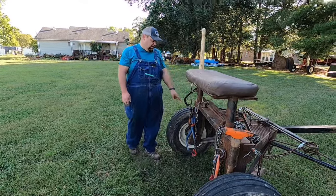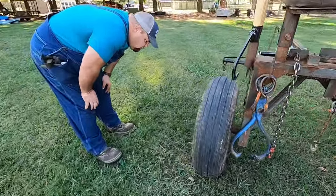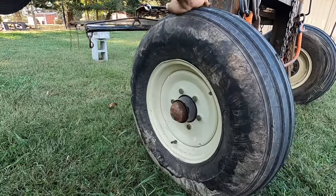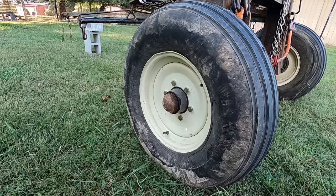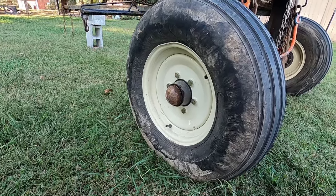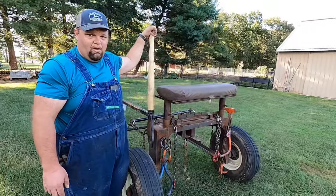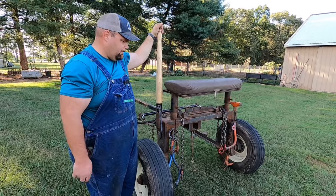These tires that's on it are, let me see here. I know they are implement tires. They're 9.5L by 15s is what they are. And like I said, again, this is a 3,500 pound axle spindle. So it's built good and heavy. These tires are a little bit taller. Now, if you got a shorter team, yeah, you could go with a smaller size wheel. And, you know, that's fine. I mean, I probably should have shorter tires on mine.